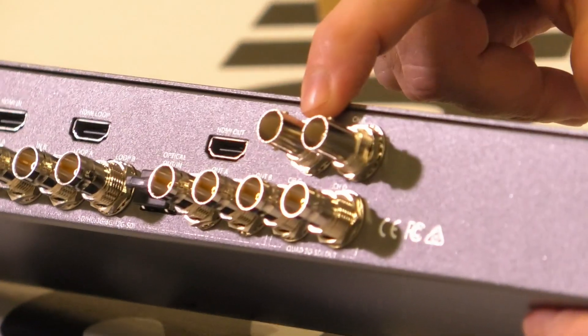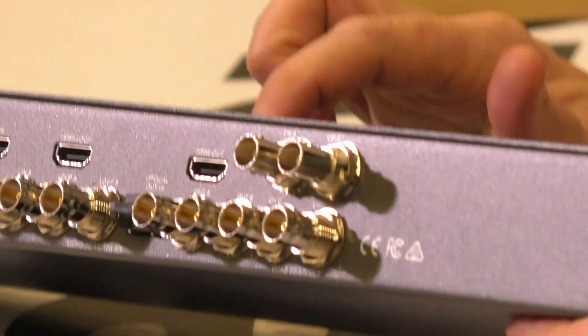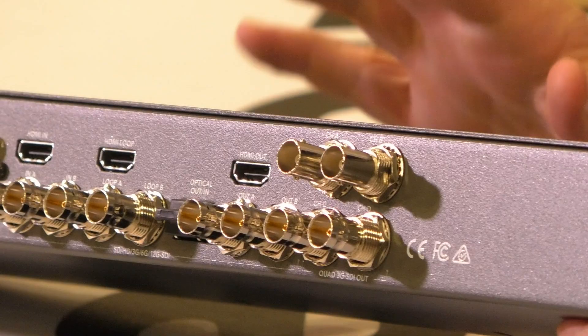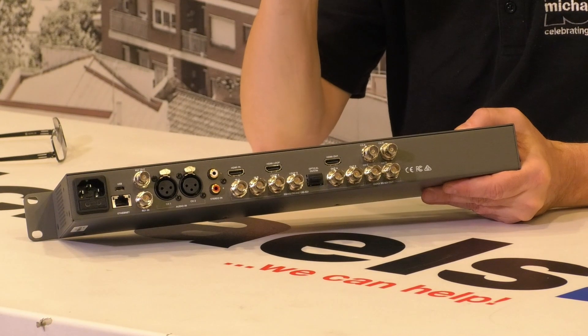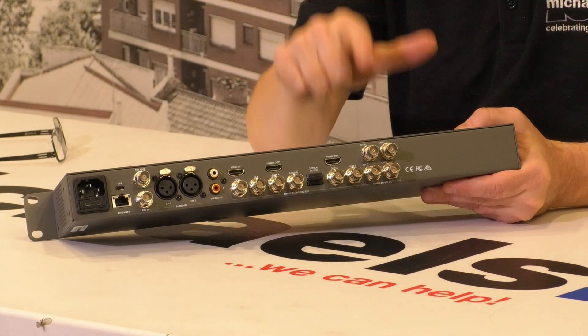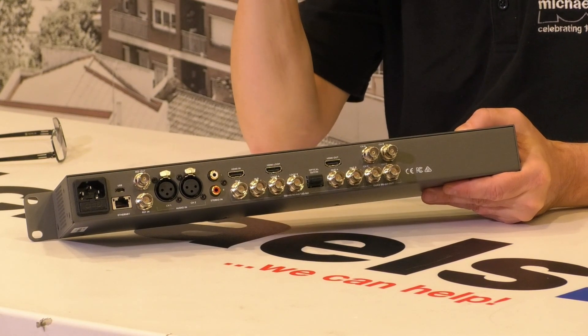This is really interesting — I didn't get into this yet. It's called Channel A, B, C, and D. This device will take any video signal you feed into it and split it into quadrants so you can run a four-television video wall. I'm dying to test this out. I don't have four SDI televisions right now, but you can make a very affordable video wall. All you need is four TV sets. Blackmagic has got you covered because you can use their micro converters to take the SDI outputs, convert them back to HDMI, and feed four consumer TV sets to make a video wall. Really cool feature.